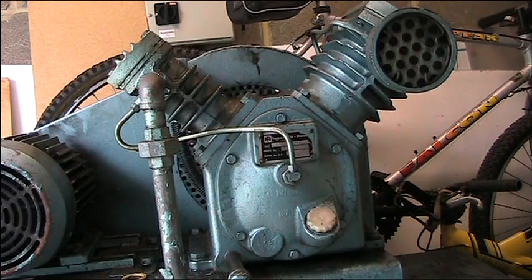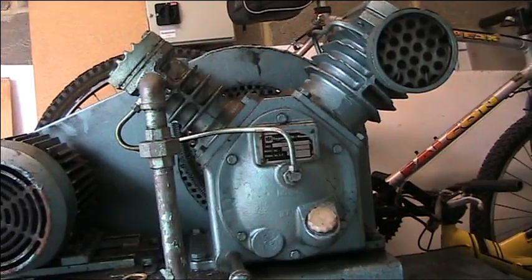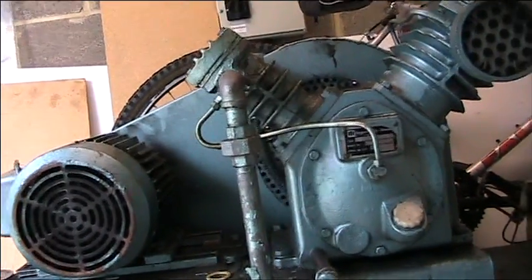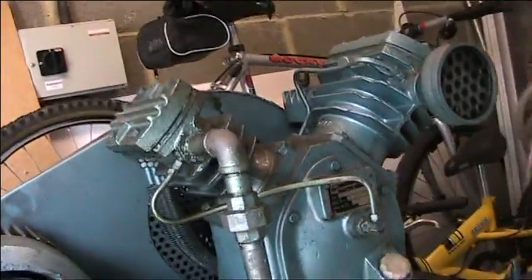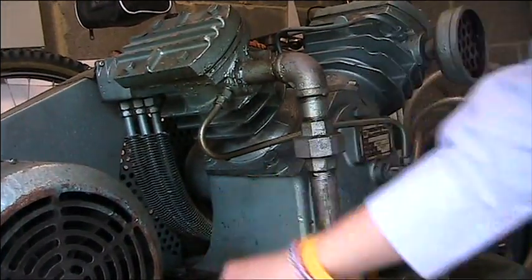We're a little short of space in this plant room, but the camera is now inside to show a couple of key features. From this position, you can see that the first stage compressor is significantly larger than the second stage, and just behind the compressor you can also see the vanes used for removing heat after each stage of compression.